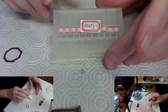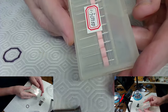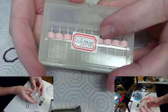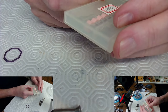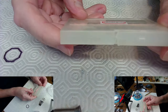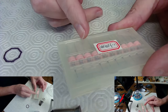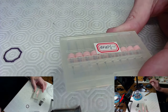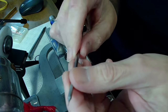Now I've got these drill bits I got from China — 0.3 millimeters, as written on the label. These little bits are great and I'm just hoping I can use one without having to taper the end, because most of the time I have to taper the end in order to get it properly lined up within my hole-drilling jig. As you can see looking down with my cameras, this drill bit has a tapered end to allow it to fit into the drawbar.